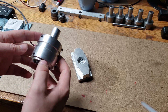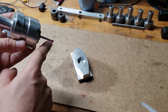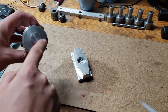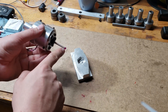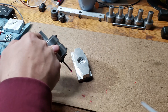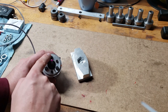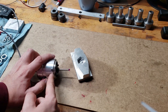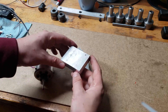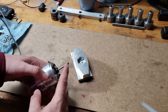In order to be accurate, you need to know where this ruby stylus — the exact center of that sphere — is in relation to the center of the shank. This is exactly three-quarters of an inch, sized for my R8 collet. This point needs to be adjustable to make sure it's exactly coaxial to the spindle centerline, and that's done with these three adjustment set screws. There's a plate inside — think of it like a tilting wheel — and if you adjust those screws, you're able to tilt that plate, which moves your ruby tip.